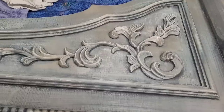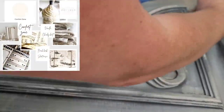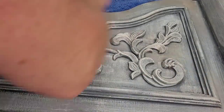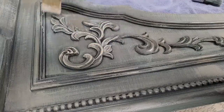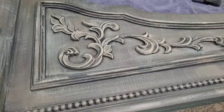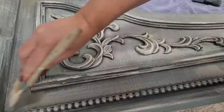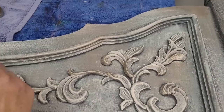Now I'm coming back with a little bit of the pure color Comfort Zone, which is a creamy white, and I'm going to dry brush this over the top of the moldings. This picks up the high points in all the details. It's so incredibly detailed — now I'll have the contrast of Metropolis sinking into all those low points while the high points on the moldings show the white of Comfort Zone. It starts taking on the look of worn linen with all those layers. I added little pops of white throughout the bed frame so they peek through.